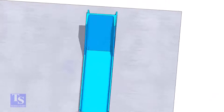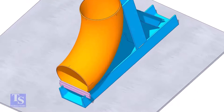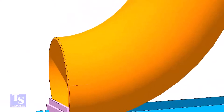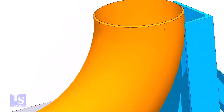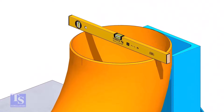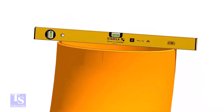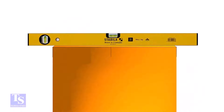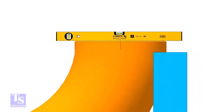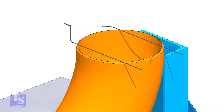Put one elbow in the bracket and arrest it from falling down. Make the top face of the elbow level from both sides, and if necessary provide additional packings. Put the gap rod on the top face and tack weld four jack bolts as shown.